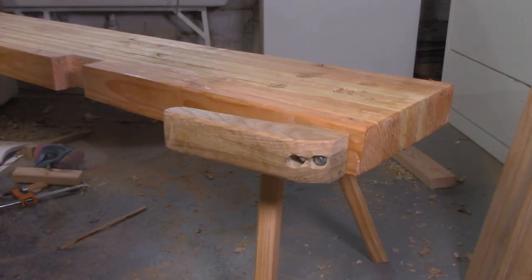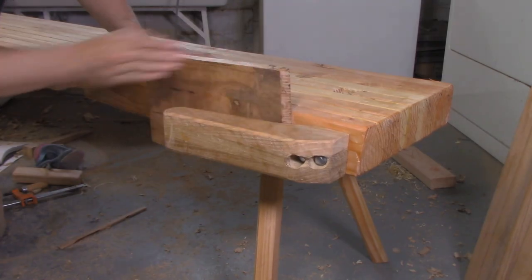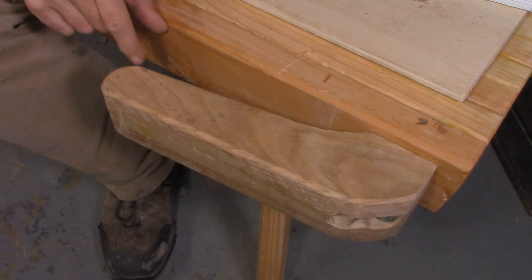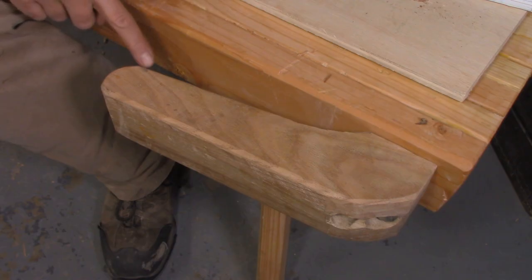The crochet is a really simple, shallow wooden hook that's attached to the side of the bench, and its holding capabilities are amazing. I made mine out of 3 pieces of hardwood. I glued them together and then got ready to do the layout, which is the most important part of making a good crochet. The wide end of your crochet needs to accommodate the biggest stock you have, so I suggest leaving 2 inches or more over at this end.